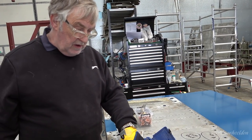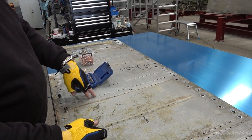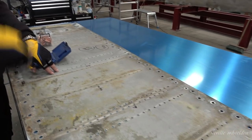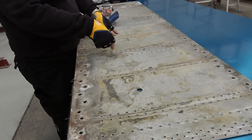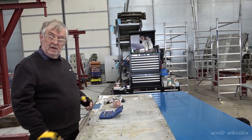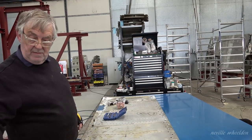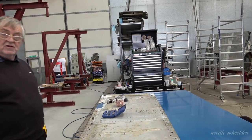The same with these ones, where these are 3/16 and some are a couple of 5/32s in there as well. Exactly the same: drilled straight into the bench and cleco pin in to hold it, so it's all held down. And then I can mark the outside once it's all pinned flat. I can mark the exact size of it. Just cut it off.